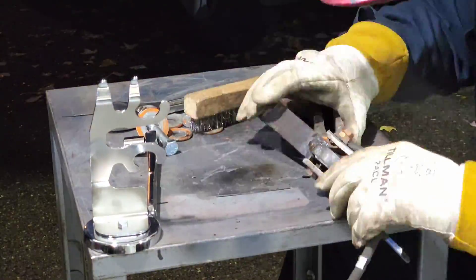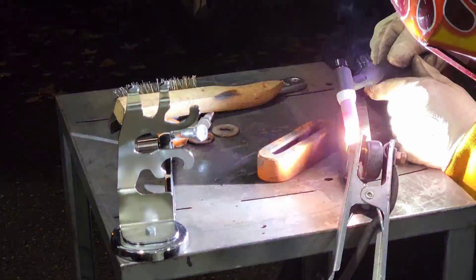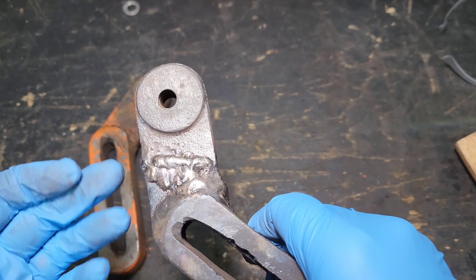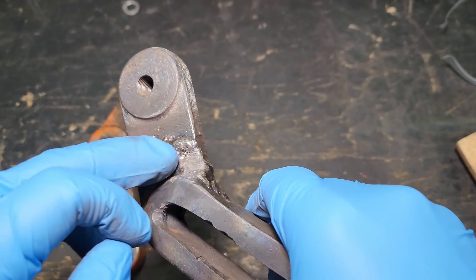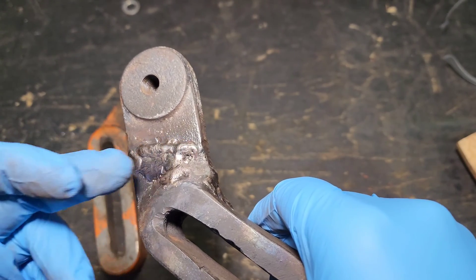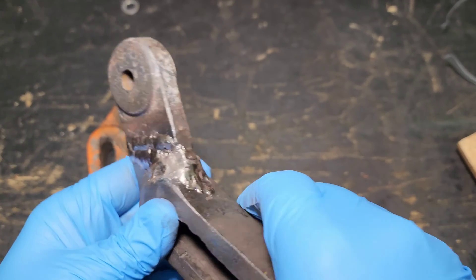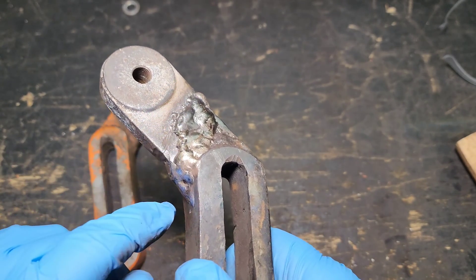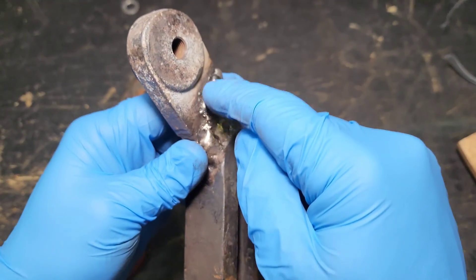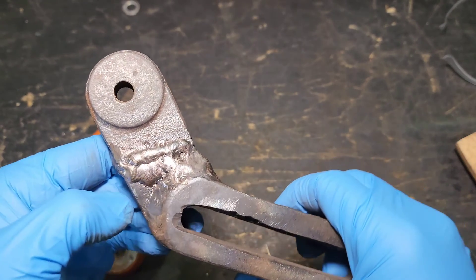This is not a how-to welding video — I am far from an expert, I am a novice at best. I am just learning how to do this; I have done under 10 of these and this is just me documenting the process. Here is the finished product. You can see I used a lot more brazing material there. You can see a little bit of porosity — those little holes there. I don't know if that is because the material was not cleaned beforehand, or if I got the base material too hot causing it to melt and interact with the silicon bronze, which will give you those little holes. But the rest of it looks like it wetted in pretty well, and I had a lot deeper v-groove channels cut in there. Taking out most of the material with a die grinder allowed that silicon bronze to flow in there better. I also had this a lot hotter using a TIG machine than I did using an oxy-acetylene torch, so I don't know if that is what helped draw that silicon bronze deeper into the crack.